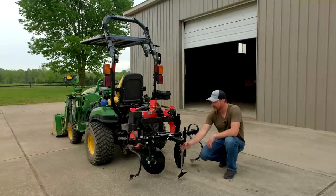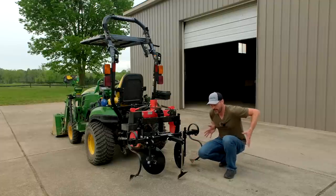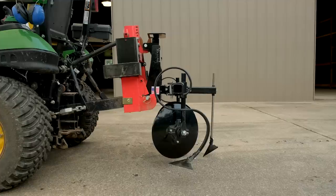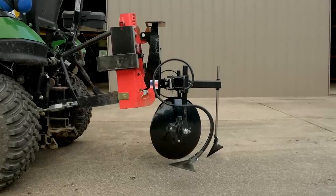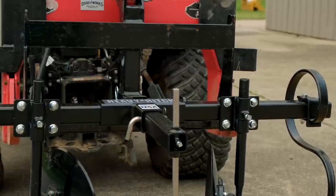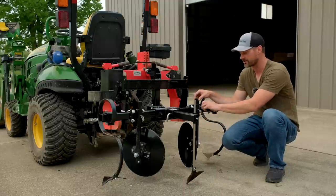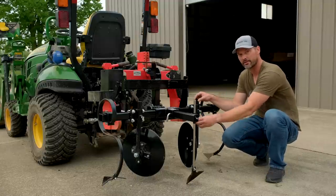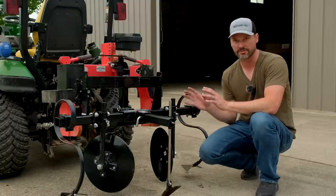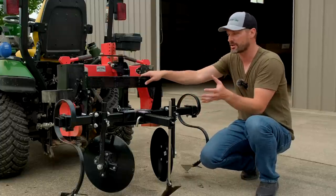This is a row maker that is completely optional — you don't have to use it. The design intent is that as you're going along making your hill, this will make a furrow so you can plant your seed if you want to do that. Everything really is adjustable on here — it's all clamped down together so you can widen or narrow up the disc. Same thing with the cultivator points; you can offset the whole thing to one side or another. These discs are locked in place by a set screw so you can loosen them up and adjust the angle left or right to make it more or less aggressive. This is going to mount to a two-inch receiver, so you need to have something like the Versa bracket or something similar on your three-point hitch to connect it to.